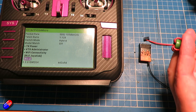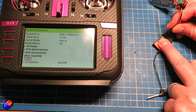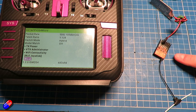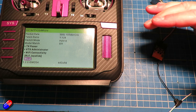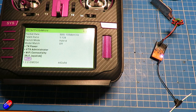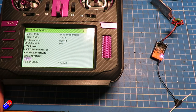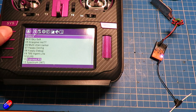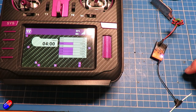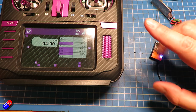On the bench I'm going to have a battery powering a 5-volt BEC, and I'll plug it in three times very quickly — one, two, three — and then when it powers up, hopefully you can see we have two blinks. We're going to hit Bind, and there we go — it should be that quick. The light goes solid on the receiver and we're in business. Coming out of the menus we can see the receiver at the top with full five bars. That is how easy it should be — however, there are a number of things that can stop this from working.